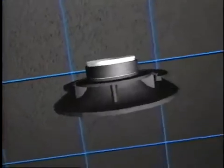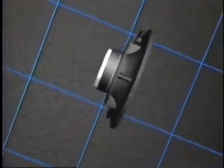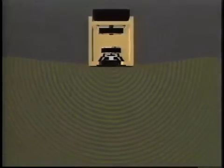The HR824 active system begins with an edge-damped alloy dome high-frequency transducer coupled to a proprietary exponential waveguide. While a flush-mounted transducer on a passive monitor beams a narrower cone of high frequencies, the HR824 launches its high frequencies from the constant directivity waveguide, dramatically enhancing dispersion. While flush-mounted transducers inevitably create edge diffraction that compromises high-end detail, the HR824's waveguide minimizes edge diffraction.